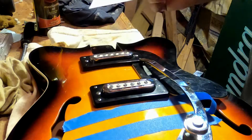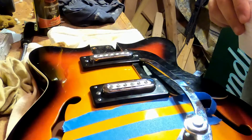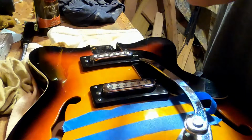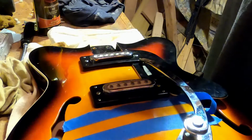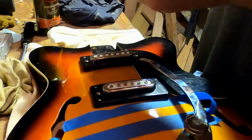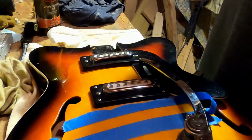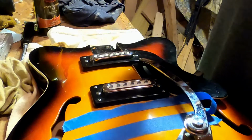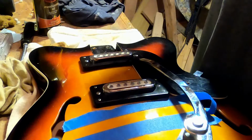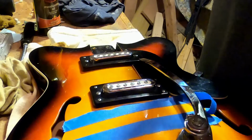This right here is your standard index card. If I'm doing my math right, and I googled it, this should be about 0.25 millimeters thick. So if I need to shim this about 1.5 millimeters. So if I do this, here's 50. Now we're going to double the 50 by folding it in half again, because you got two layers here. So 50 plus 50 is a hundred. Right? Yeah, I got four layers, so that should be 100. Now if I fold this again, I should have my eight layers.